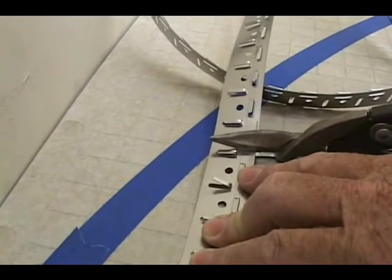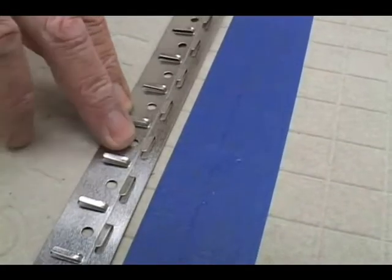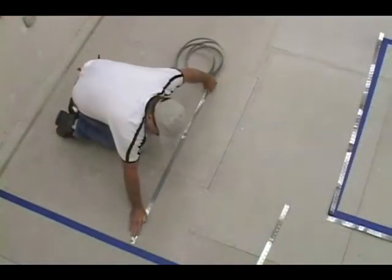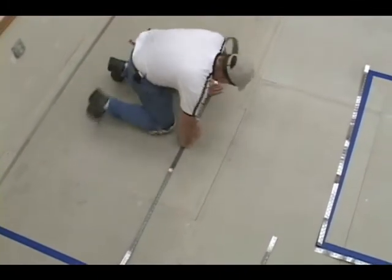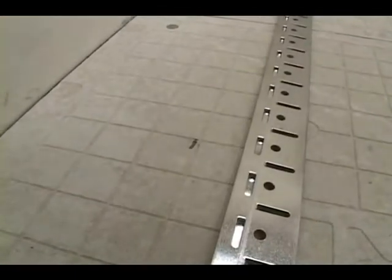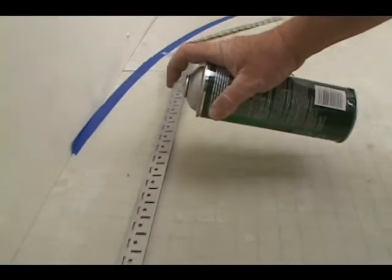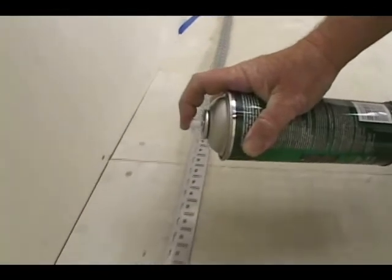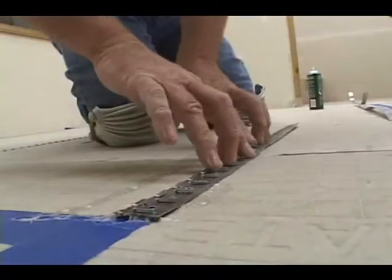Use your metal shears to cut the straps to fit the perimeter of each area. Remember to point the tabs toward the wall or the outer edge. In the larger areas, we're installing the strap between perimeters to hold the wire in place. This is a good idea when distances between straps exceed four feet. Turn the strap over and position it just below the line where it will be installed. Spray the back with adhesive. Notice that the overspray covers the original line. Let the adhesive dry until it is tacky, then press it in place where you see your floor marks and the overspray.